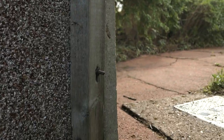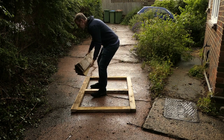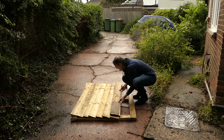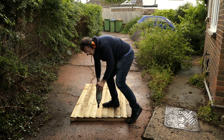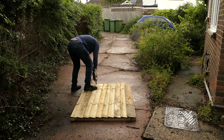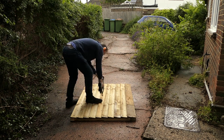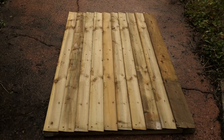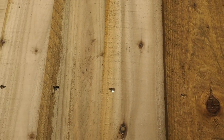I'm back at the location where I'm going to be fitting the gate. I've made sure the hinges are all solid and secure and the bottom one's fixed. Now to nail the feather edge boards to the gate structure. I'm going to use a nail gun — it's just a bit quicker, but you can use a hammer and nails if you want to.